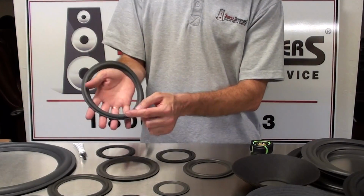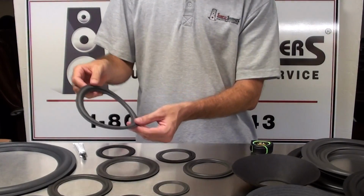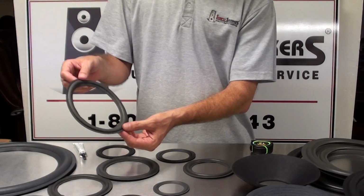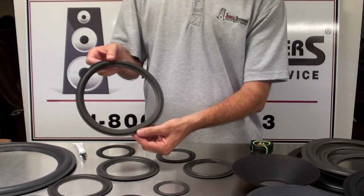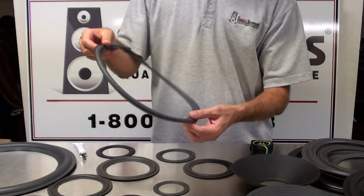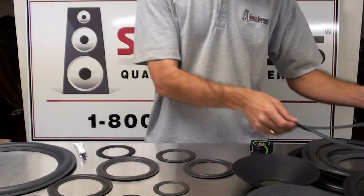It's a much thinner roll here, okay, and a much skinnier outside area here, specifically for the square frame JBL drivers. Part number starts with LE on the driver frame, so pay attention to those. We have it in the LE8 style, the LE10, LE111 style here, the LE14 and LE14A, H, and LE14C drivers use this particular foam edge kit here.